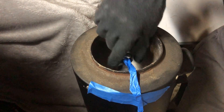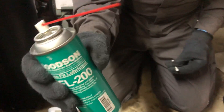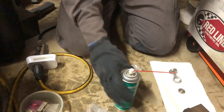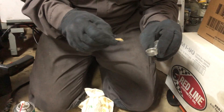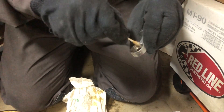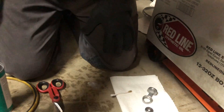This is just masking tape. There are two things I'm going to do with the piston: I'm going to put just a little bit of this press fit lubricant on the piston in two places — this is to avoid galling — and I'll put it on the sides here like so, and on this side like so.